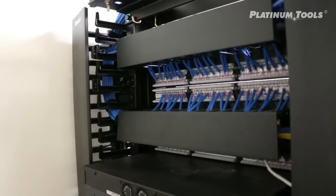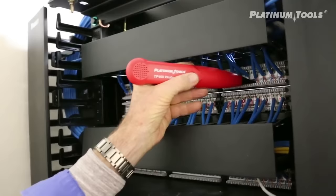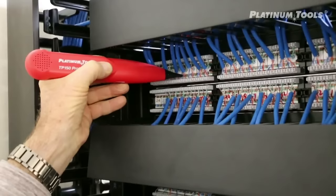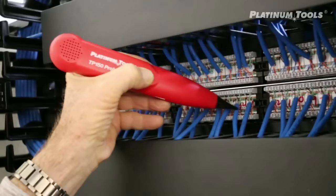Okay, we're in the server room — let's find that cable. Now remember, I hooked up pair 5-4, blue/white. So when I go to my panel here, I'm going to work on the side that has the blue/white pairs. Let's see if we can find this, because that's what's going to be shooting the tone. No need to be up there where the orange and the greens are. Okay, nothing there, so let's go down here — somewhere something's got to sound off.